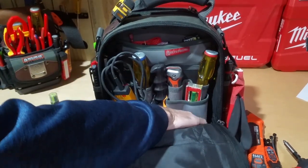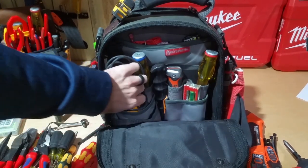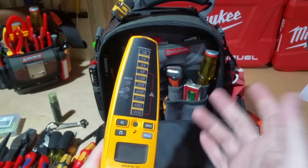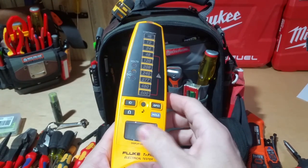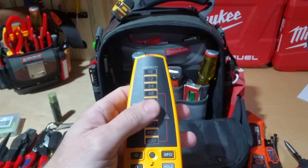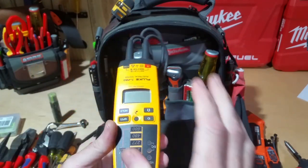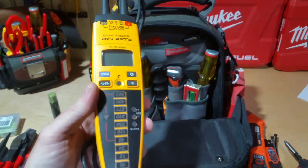Down in the bottom I have some electrical tape in case I end up needing it. Here I keep the Fluke T+ Pro — I like this meter for quick electrical checks. You can't check everything with it but it's nice to see what kind of voltage you're dealing with; it gives you a digital readout of the voltage, checks continuity really quickly, and it also vibrates to let you know certain things. It's used primarily for electrical. You do need batteries for the digital display, but all the core functions work without batteries if you're working on something that's got power.